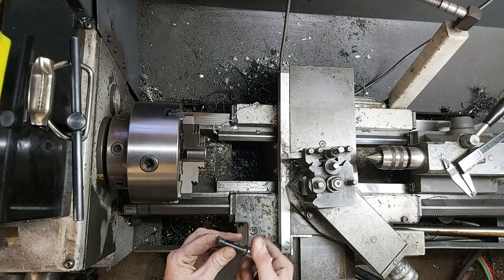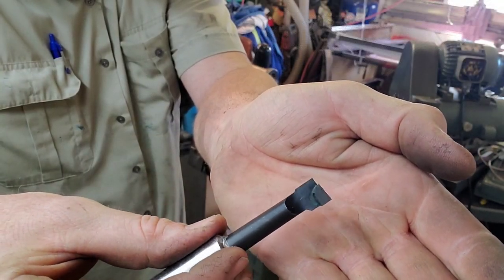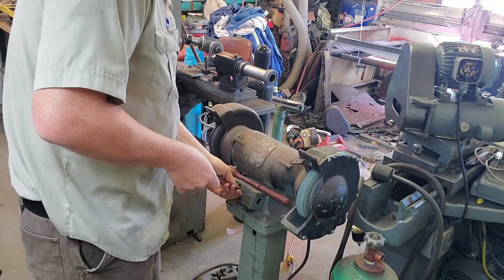One of the things I'm noticing right out of the hop is that it's a little bit too big for the size of diameter that I have to bore. The back part of this tool bit is going to rub on the bottom if I put it on center.